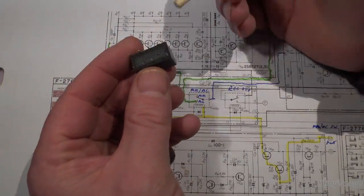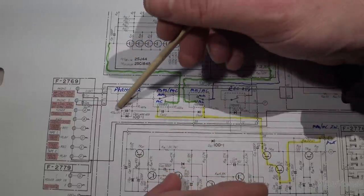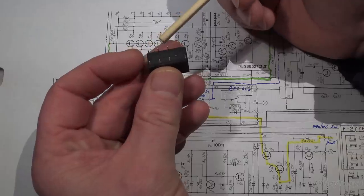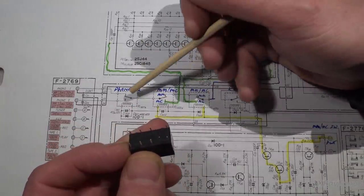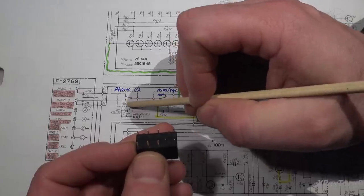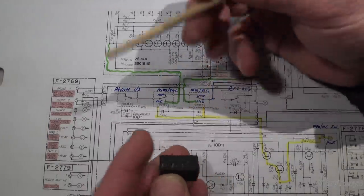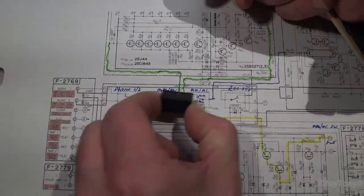If you look right here, you have these two contacts, or these two little terminals here, on the end. And those connect to this little coil down here. So that represents the coil. And when we energize the coil, that's what pulls this in. And then if you notice, there are six other contacts, three here and three here. Well, you have your common, which is your actual switch here, which is this terminal. And then you have your normally closed, which would be this one up here, and your normally open, which this one would close when you energize it, right here. And then for the left channel, so there's your right channel, and then left channel, you use these three. So this represents this half right here. And so anyway, you have two of those relays, so one here and one here for the two channels, half and half.